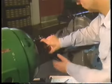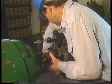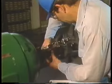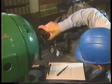We've obtained dial indicator readings that can be used to determine parallel and angular misalignment in the vertical plane. However, we'll have to take another set of readings and compare them to the first set. If the readings are the same, we can be certain that we have an accurate set of readings. If one or more readings don't match, it indicates that something has slipped and it will be necessary to make adjustments and recheck the readings. It's extremely important that any measurement taken when performing a shaft alignment is repeatable — when you check a measurement for the second time, you should get the same results as the first time.